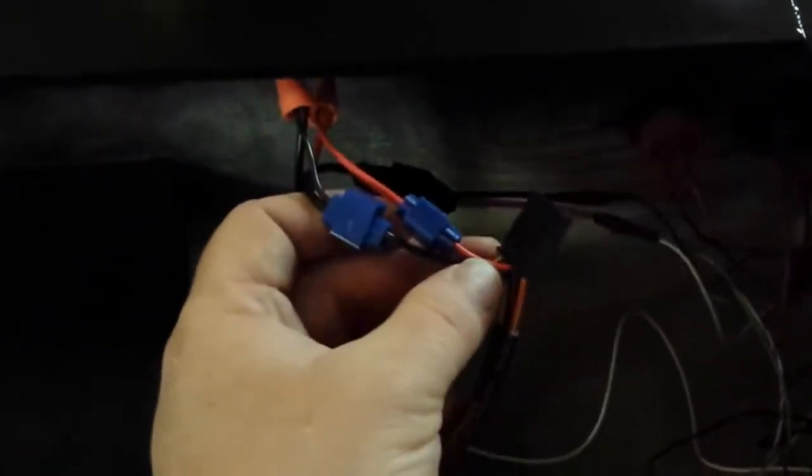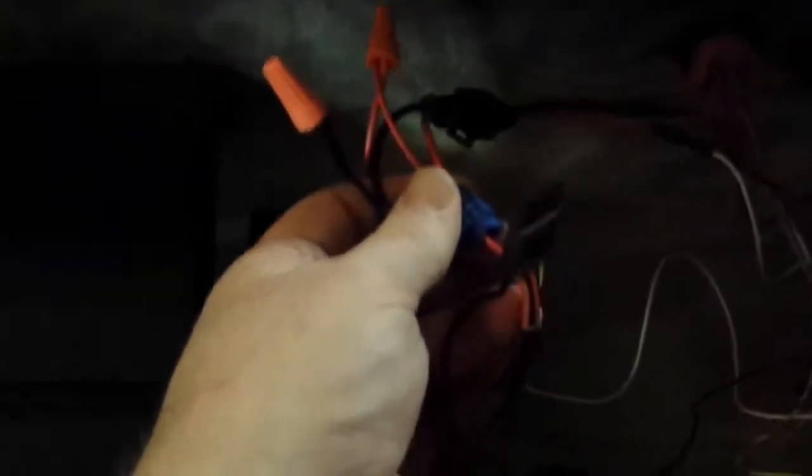12 volts probably would have been better for running this whole series of lights. I have those 4 lights on one circuit, or, well, just on one loop of wire here, and I have the plunger button and the Nova Gem coin button on another one, and I gave each of them a plug so I can unplug them from the power supply if the power supply would ever need to be removed. And I have those spliced into one of our lines from the power supply, and you see they're coming off of the 5 volt, which is the red line.